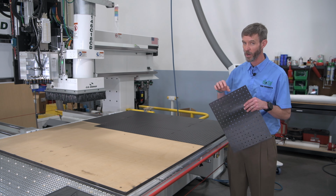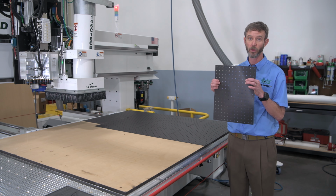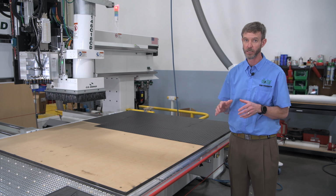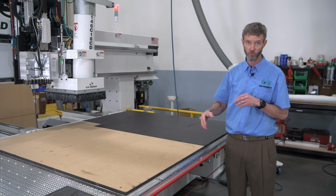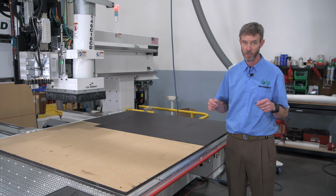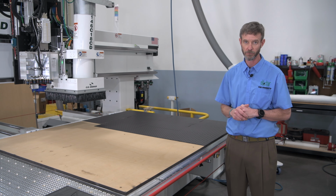And as we start to wear these items, just as you would a spoil board, instead of spoiling the board, we're gonna spoil the tile. And the idea is as that tile starts to wear, we just replace one tile at a time, no need to continue to downdraft your spoil board or fly cut, reset your tooling depths. This is gonna be your surface, your Z depth the whole time. Very easy to get more production quickly while doing better vacuum systems with the tile gasket material.